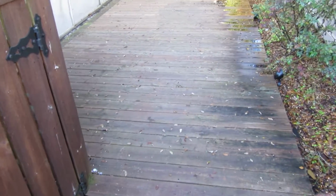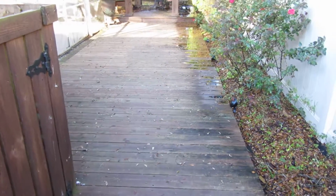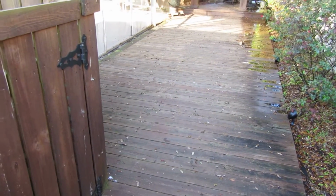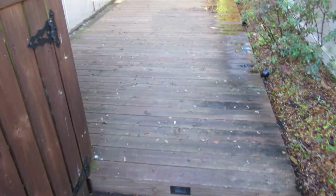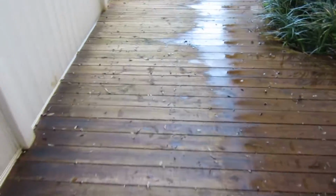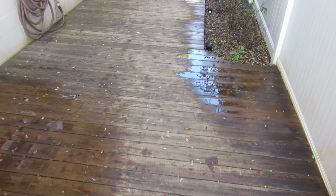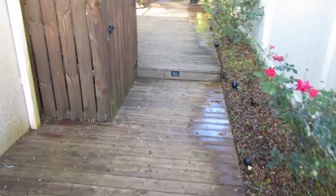The problem, like I said, with these oil-based stains, besides the fact they dry too hard and crack and break, they attract mildew like crazy. Every time you top coat them, they get cloudy. They fade so fast. There's no color retention in oil-based products at all, especially in the stains on a horizontal surface that's taking the blunt of the sunlight on a daily basis. So switching this to a water-based stain is certainly going to cost him some money.